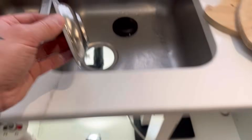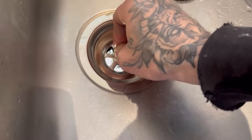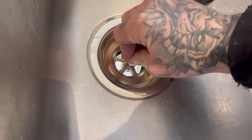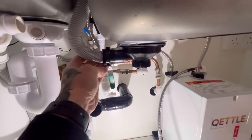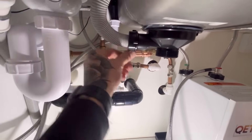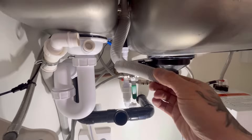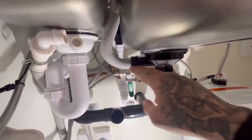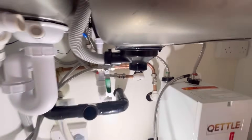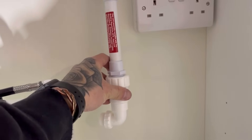The debate that'll go on till the end of time - do you silicone your waste or not? This is a handy little tip I seen on Blue Bulldog's YouTube last week - 50 pence piece. Perfect. The overflow's reconnected in. I had to cut a bit off because it was too long. Some people will let this droop down and then back up, and it just gathers water like a trap and starts to smell. When they're short so they fall back, they can't hold the water in - they don't have any sitting water, should I say. Just thought I can't put it in there after the trap - a little bit of smell backs up through that.